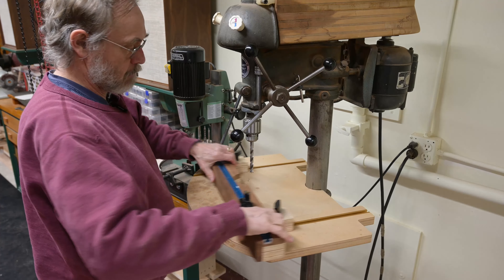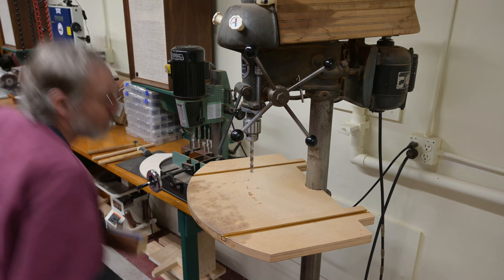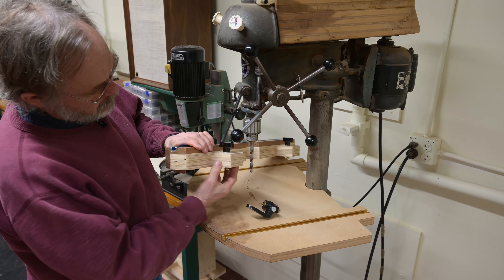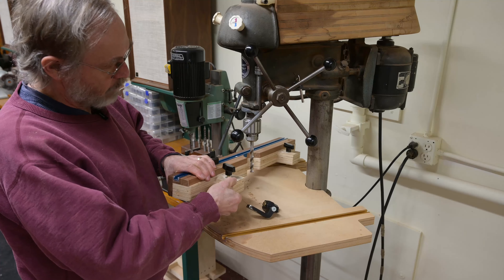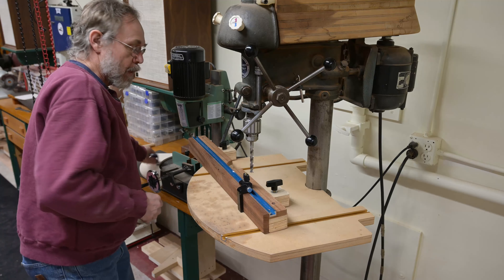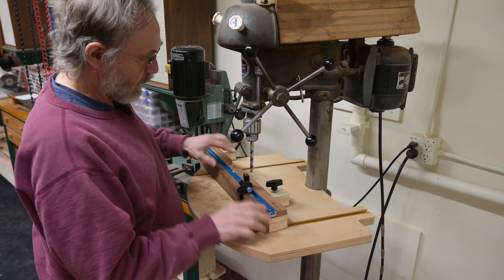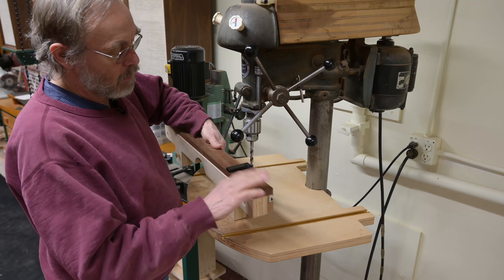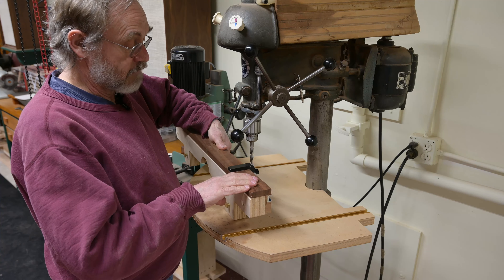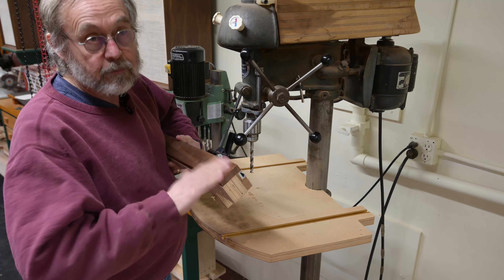This is the fence. It has stops. It's cut out in two sections — two pieces on the CNC — and sandwiched together to get the height to match the stops. This top piece here is solid wood. I put a channel in it for the T-track, and I clad it with solid wood on the face. That way I can go over to the jointer and keep it square.